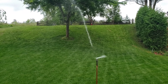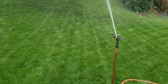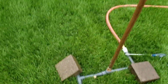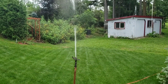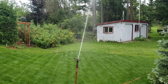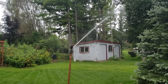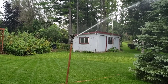Okay, so again, 1/8 inch nozzle on this guy, 40 PSI static town pressure. And we are sitting around 40 PSI dynamic pressure as well. So that 1/8 inch nozzle really helps hold the pressure in the line there. Quite an aggressive angle on this sprinkler — you can see it's going up very, very high. It's shooting about 40 to 50 feet right now.